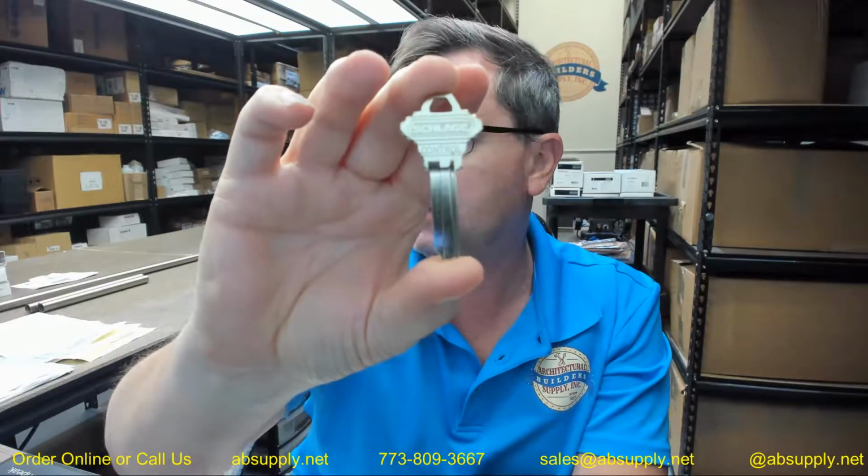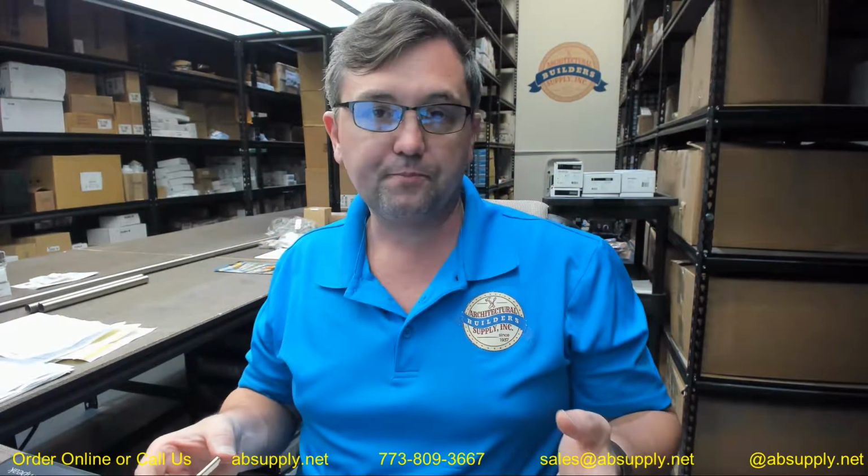Hello, this video is to bring you a closer look at the Schlage number 35-056. That means this is a control key with an embossed face on one side. It will be blank on the other, and the reason it's blank is it gives you some room to stamp something there should you need. It also is stamped control because it is a control key, and a control key is used to insert and remove Schlage full size or large format Schlage removable cores.